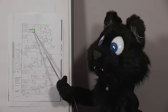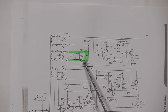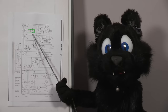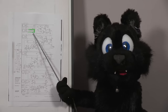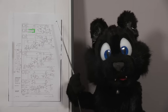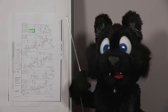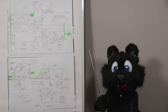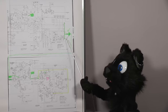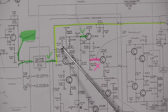Turns out that these are the limiting resistors for the 50V supply of the step generator output amplifier. And they dropped over 8V when turning on, giving a current of over 2.5 amps. That seems way too much, even for a very power hungry and misadjusted amplifier. I double and triple checked every connection and even followed the signal. Step generator output is fine when it enters the amplifier, but is lost halfway through the final stage.